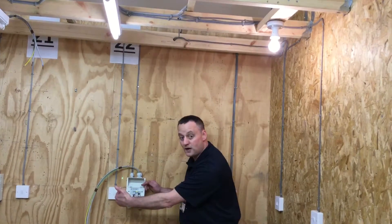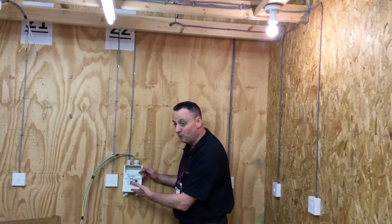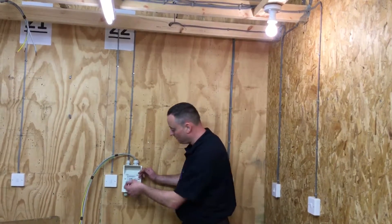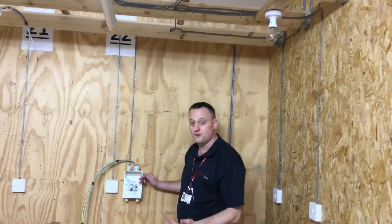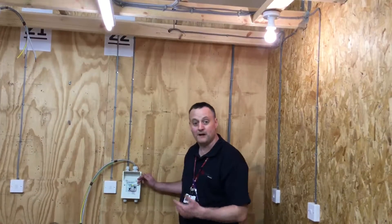Select the appropriate circuit breaker for the one you're testing. Because there is only one here, but if we had several circuit breakers, the one labelled for the lighting circuit - maybe the downstairs lighting circuit - needs to be checked, so when we turn it off the appropriate circuit goes off. Checking it's 6 amps, rechecking it, it comes back on again.